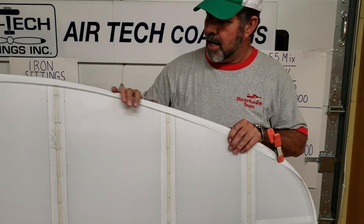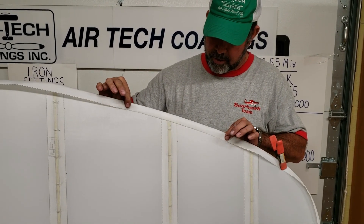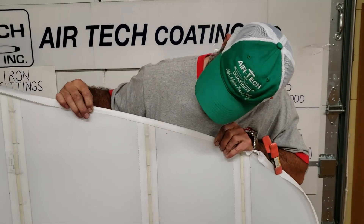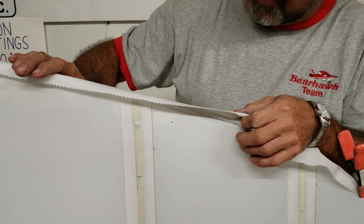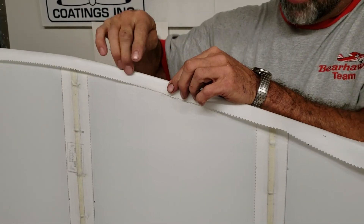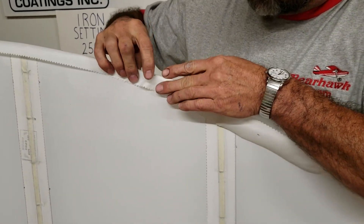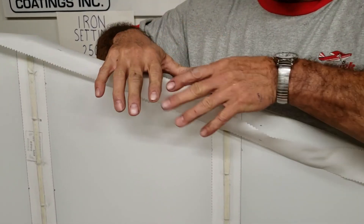I hope you got something out of that, for the beginners especially. It's just a neat product. When you pull that tight, you can see how much I'm sliding that. If you keep pulling it, see how much above the line it is — I've done got it so narrow it ain't doing any good. So when you pull that line down, getting it all centered, you do that first pull just enough that it starts laying over. When you glue that back, you're going to think it's kind of wrinkly — but you can work your wrinkle up that way, then come back and work the wrinkle up the other way. If you've got a wrinkle and it's glued on both sides, take that brush, just mess with it. It's amazing — I don't know where the fabric goes, it goes in amongst itself somehow. It just flattens right down.